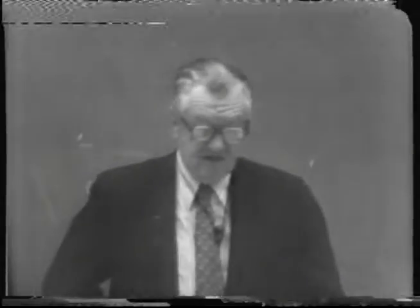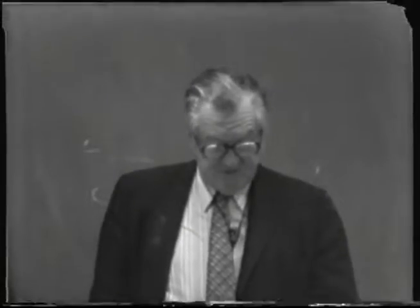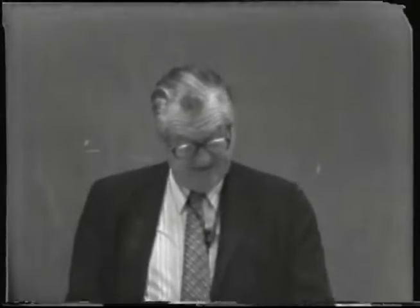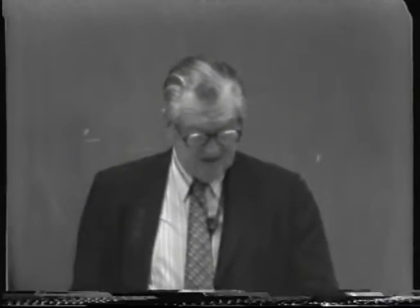And the first step in the distillation is to run it through a beer still. So if you're looking at the last page of this diagram, you'll see that the column on the left is labeled beer still. And it is simply a column with about 20 sieve plates in it, perforated trays. The top section, three or four plates above the trays, may be bubble caps so that they get a slight concentration effect. The beer is run through, in this case, the diagram shows three separate heat exchangers. But anyway, the first condensers are usually the beer heaters. And so it's preheated and then goes in near the top of the column.